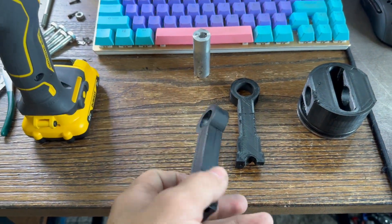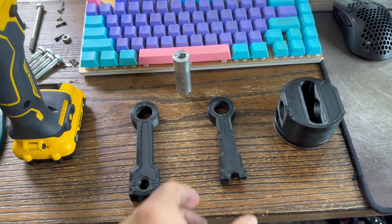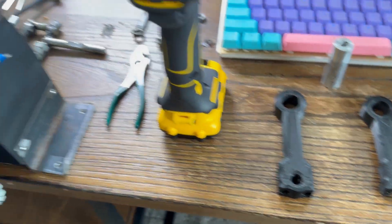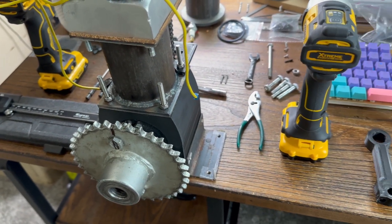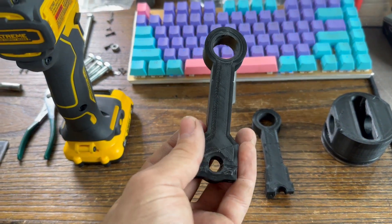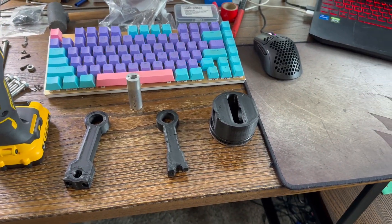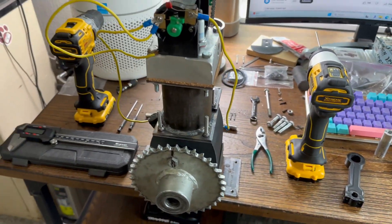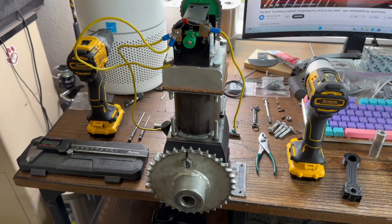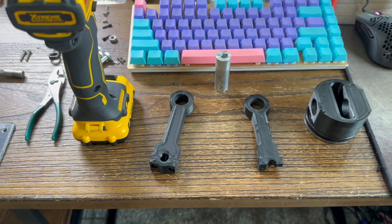Here is the new connecting rod — it's two millimeters thicker than the last one. I'm a little hesitant to use it though; I'm reprinting the piston right now, but if that snaps again my brand new crank case will get destroyed. I increased the thickness a bit so hopefully it's stronger. Once the piston's done I'll be able to assemble it, and the carburetor is arriving tomorrow so hopefully everything will be ready.